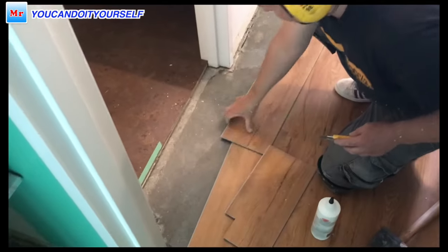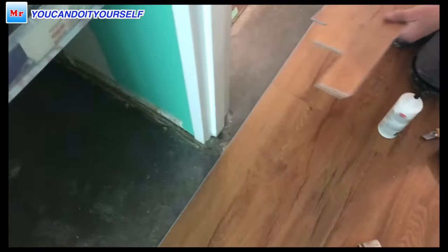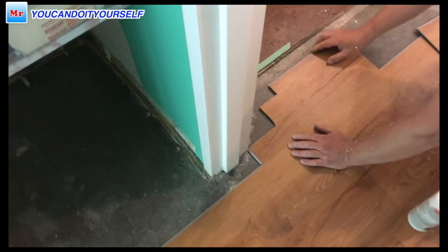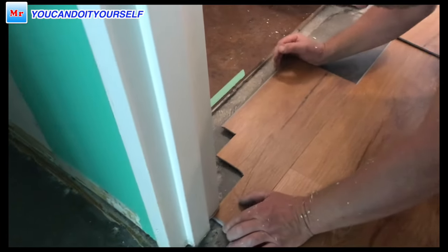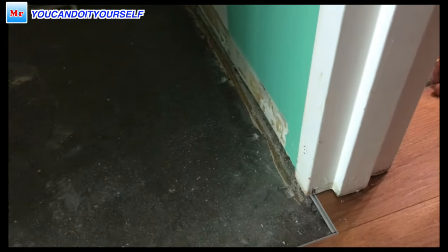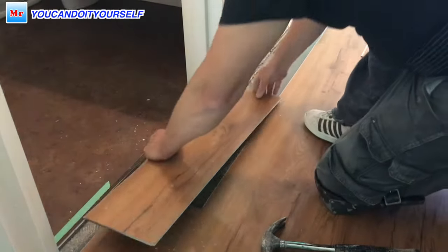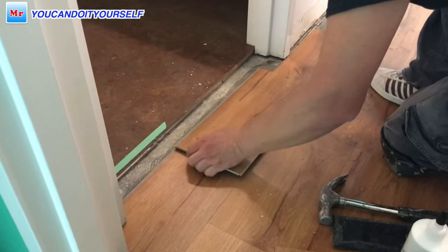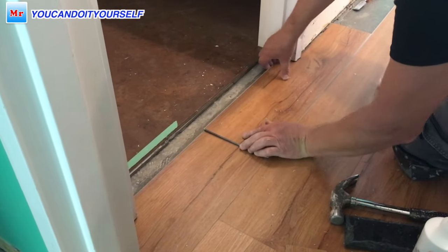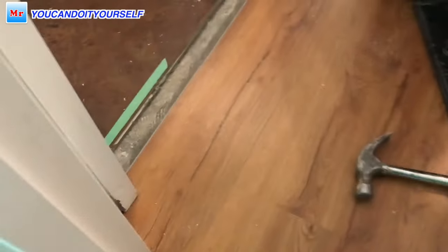The main thing here is we have to cut this board in half. Why cut it into two pieces? Because it's very hard to slide this board in — you have to cut a groove and glue the whole piece, and it's not a good idea to glue a whole board. So easily slide one piece to one side, then slide another piece to the other side. Make sure this joint is far away from other joints — like here it's approximately six inches, as you can see. When you install these two pieces, you see it's possible to do it.